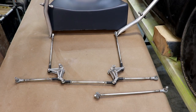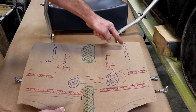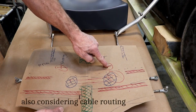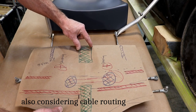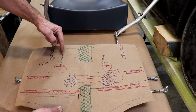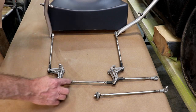Once I had a paper template made up, I brought it over my steering layout to make sure I was covering all the things I needed. I need an entry area for the control linkage from the steering system, steering linkage mounting here, the rear end of the boom — the rear foot of the boom — and the idler wheel over here that's going to be covered with a shroud. These will be access panels so you can set the toe-in and toe-out of the machine.